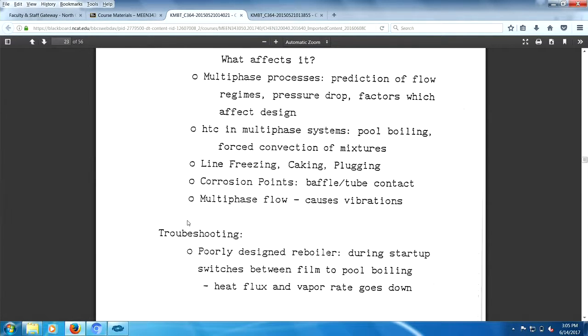You should perhaps, if you're really conscientious, you probably already have a tube bundle made up for you, right? You may want to have a tube bundle ready for insertion. That's if you had a lot of money and were worried about downtime. Stop to think about a tube bundle. Maybe $40,000, $70,000. I mean, let's retract that. I'm not sure. We're talking about the heat exchanger being $1 million. So, okay. Say it's $1 million. Say the tube bundle, a new tube bundle, is $400,000. Okay. And your plant is making $100,000 a day. So you're making $100,000 a day, maybe $50,000 a day. So in 8 days at $50,000 a day, you have essentially equaled the purchase of that tube bundle.